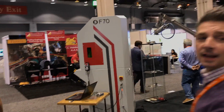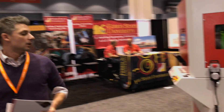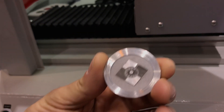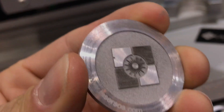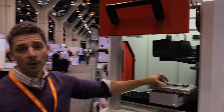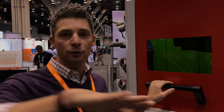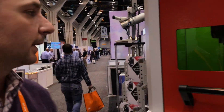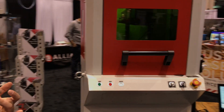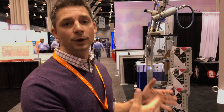We're going to come over here. This is our 70 watt laser engraving unit. It just finished engraving. This is a piece of aluminum — aluminum is a very hard metal and you can see the depth in that engraving. This also has a focus shifter built into it. The focus shifter allows you to engrave in a bowl shape, essentially — it moves back and forth with the Z-axis. We can adjust the power if you need it, we can make the cabinet bigger. We can make this machine what your company needs. It is not an out-of-the-box solution — we talk with you, figure out what you're doing, and go from there.